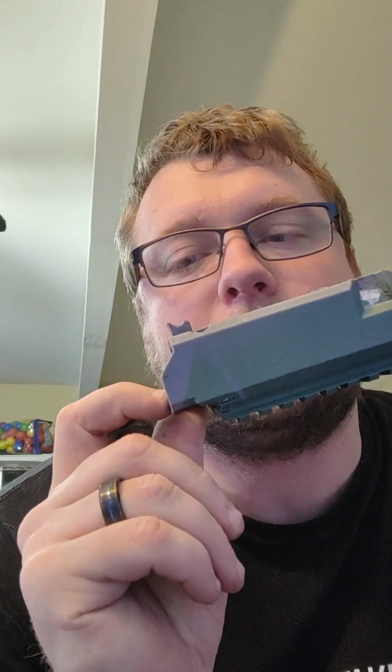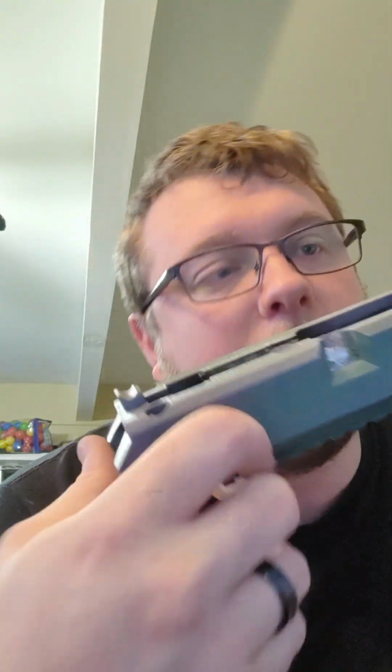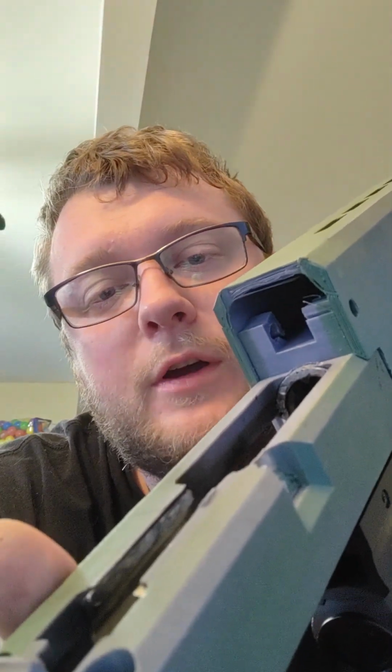All right, upper. Currently, there is definitely some barrel wobble, as seen. On initial assembly, the first time I even tried to put this together, the rear takedown lug broke. You can see what's left of it, that profile was very small. It needs to be a lot beefier, obviously. The solution is fairly obvious, and that's why in all of the actual test firing there was a zip tie in place.